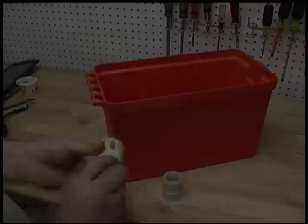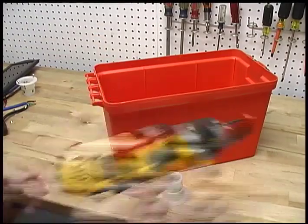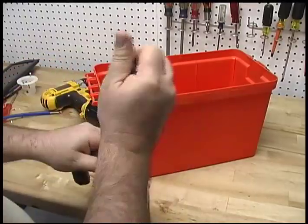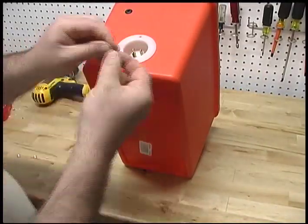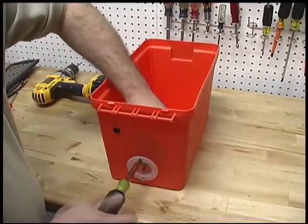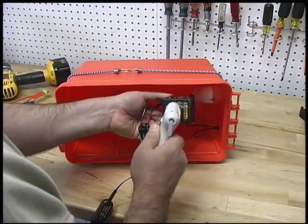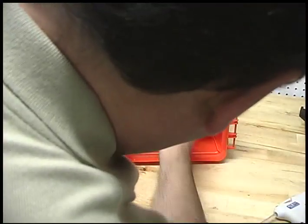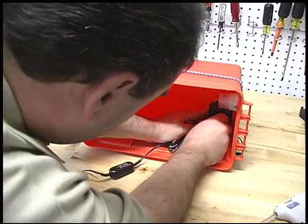Let's get started. Assuming you want to be able to charge your power box with household electricity and not just solar, we're going to make up a plug and a jack pigtail. Next, using a 1 and 3/4 inch hole saw, we're going to carefully drill a hole in the side of the tackle box. Now we'll mount the receptacle using screws and nuts to hold it captive, plug in our trickle charger, and use the hot glue gun to glue the trickle charger to the floor and side wall of the tackle box.